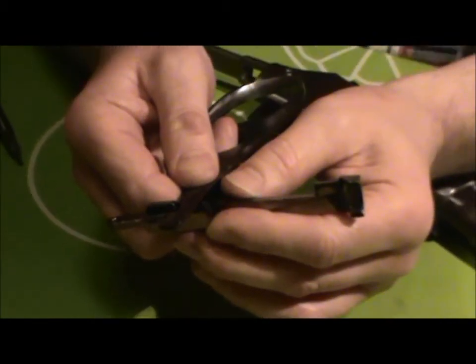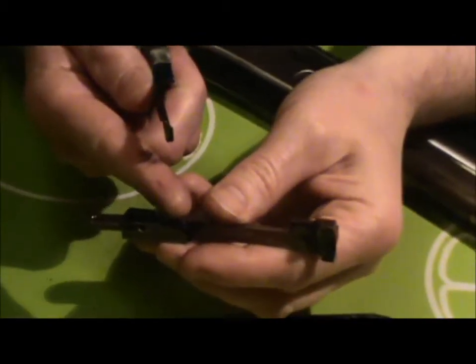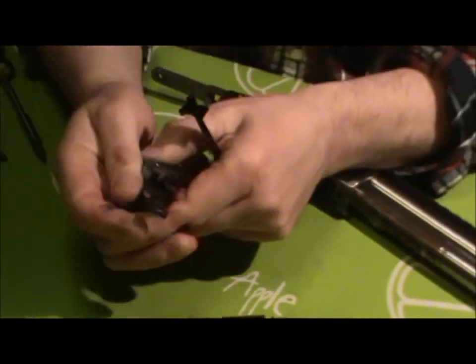I'll probably never bother to open the gun again. But I have this surface — I've honed it. Then I got greedy: I took a file and I filed it. You can round it here, take the sharp edges away, sand it, file it, stone it, smooth it. Am I happier? No. The best way is to take grinding paper — sandpaper, emery paper, whatever you call it. Follow the curves. Polish this one with a paper that can follow everything. Polish up, polish up, leave it alone.